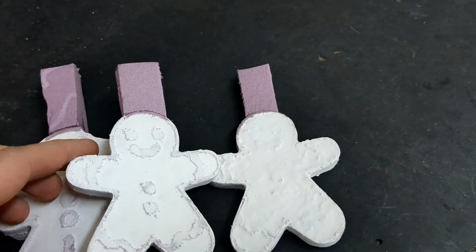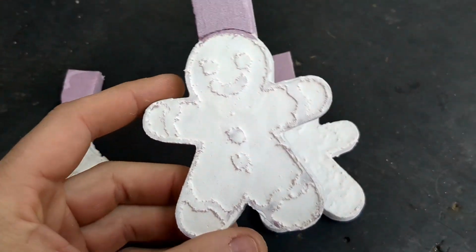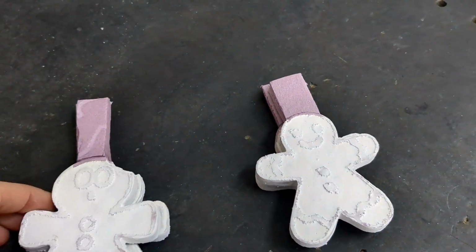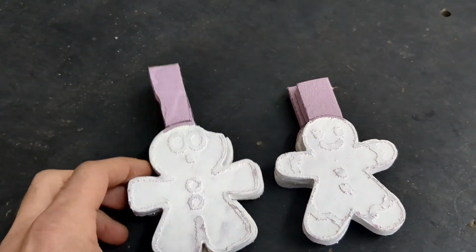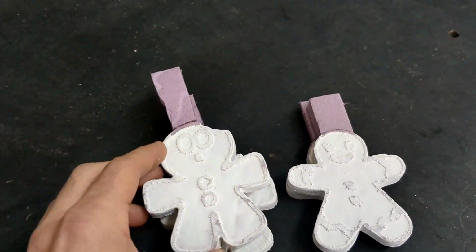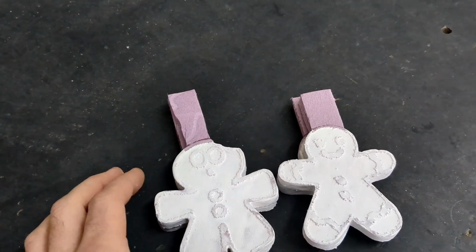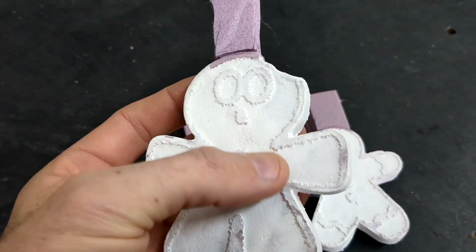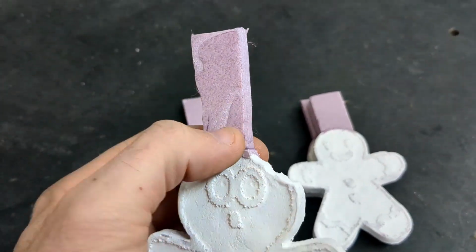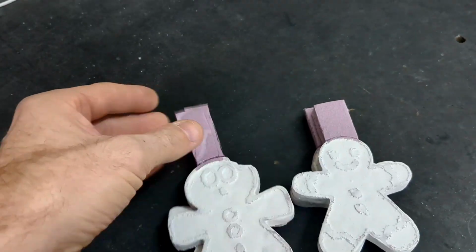And these are the other two that I made. And again, a thicker coat on one and a thinner coat on the other. The coating I have here, if you're not aware, is drywall mud. It is just strictly drywall mud mixed with water. So I always coat these before I cast them because the drywall mud actually gives it a better surface finish, because without it, you're going to get the grain of the sand, and you'll actually see that when I remove this later. You'll see how grainy this smooth piece of foam is from the sand.